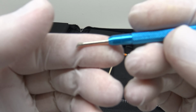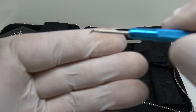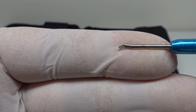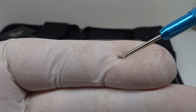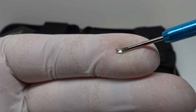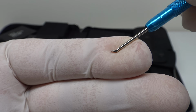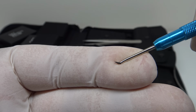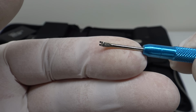One also gets two of these. These are hand removal tools, with a nicely knurled aluminium body which is anodized. You use these like pry bars. They pry the hands off the cannon pinion. So there's a pair of these. Now if you make a mistake in setting the hands on the cannon pinion, you can simply use this hand removal tool, the pair of them, to prise back up the hands off the cannon pinion. They're an absolute pleasure to use.